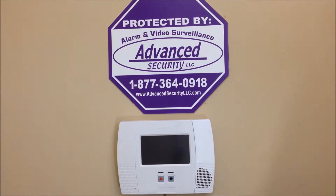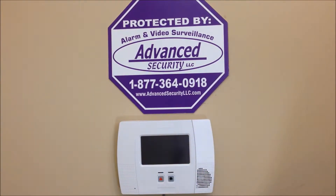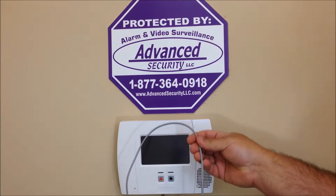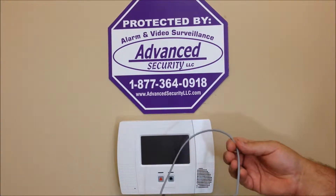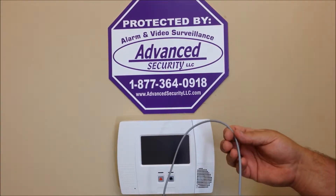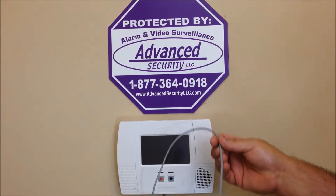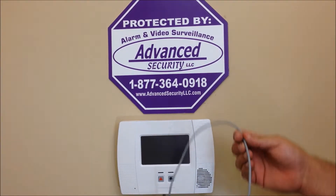To get started we're going to need a pair of wire strippers and a small screwdriver, as well as the wire you plan to use to connect the control panel to the transformer. We're using a 22 gauge two-conductor wire here. You can also use Cat5 network cable or telephone cable — it's all low voltage, so any low voltage wiring should be okay.